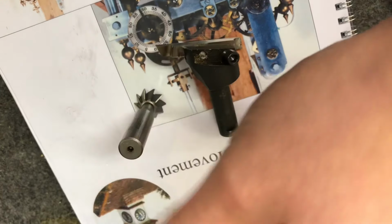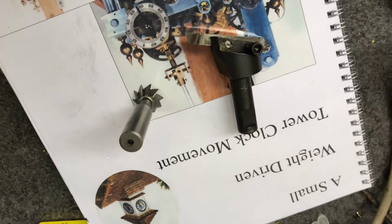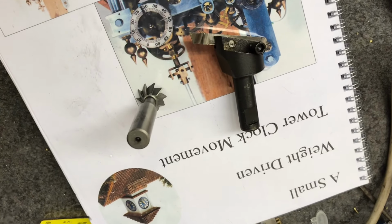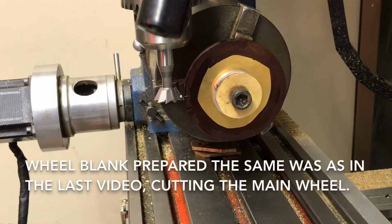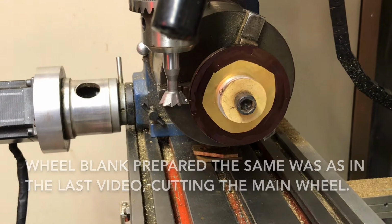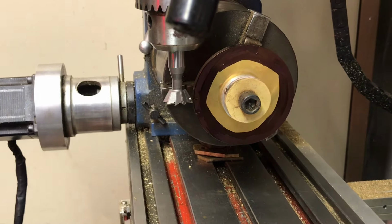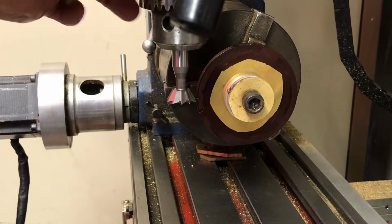And to get the undercut, it actually tells you in the book how high to lift it to get a 5 degree undercut, so I'm not going to put it central, but I'll talk more about that when I get on to it. I just wanted to show you this way that I've set the cutter height now. I used to do it purely by measuring. And although that should be super accurate, I just find this method far, far better.